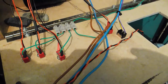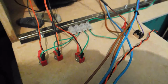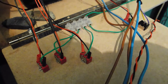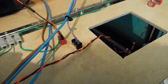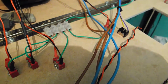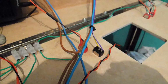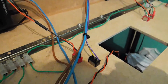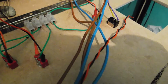The switches, can't remember where I got them now. I think they're Expo ones. Yeah, simple center off. That is a on-off switch. I use red, green and black for point control. Purple and the yellow is just for any old 12 volt feed, and the heavy gauge brown and blue household wire is to the track feeds.